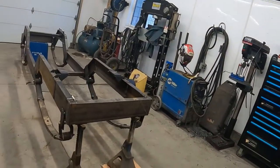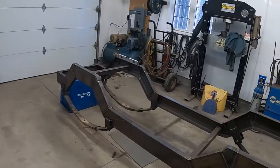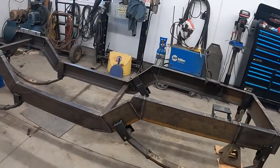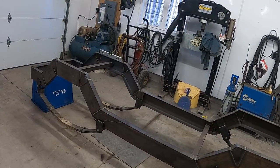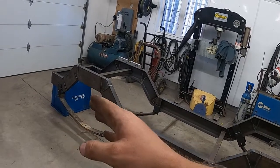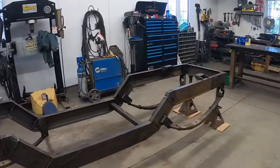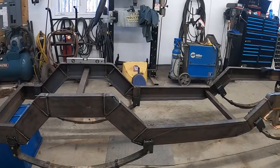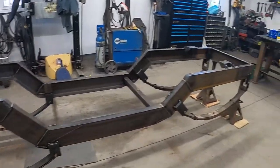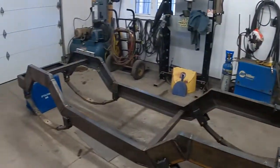It's how to install a suspension kit, just by guessing, basically. All Jeeps have a hanger in the front so the springs can move a bit, and the hangers in the back so you can move a bit. Weld the two inner ones solid, and use your springs as your guide. So get a point near the back, center the axle in the center of your frame, and then you kind of start at the back and go to the front, and the springs help a lot to get them bolted on. They're just loose in there right now, but it looks pretty good.